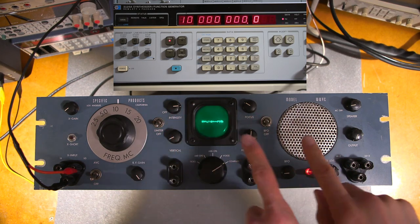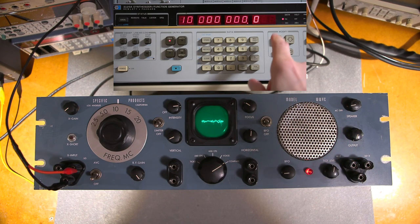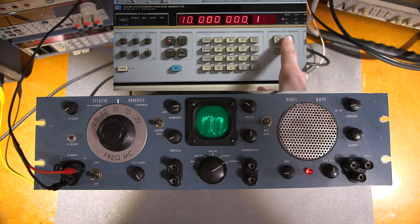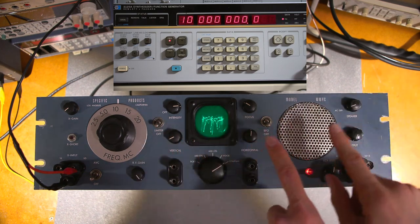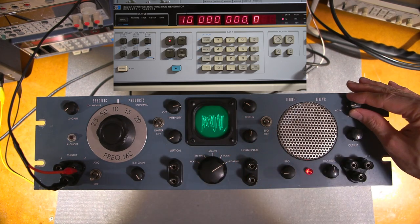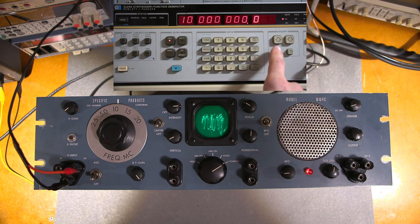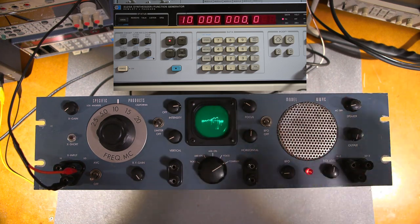You need to start them right at the same point of the cycle. If I started at a different point of the cycle, the static will be higher. Now they're locked — they're the same, still moving at the same time. What's happening is I'm starting them at a different portion of the cycle, so I need to try and sync them. I'm looking for the least amount of noise when I hit 10 megahertz. There we go — I've got them very close to being in sync.